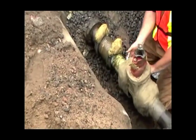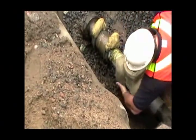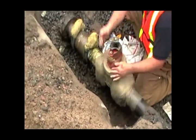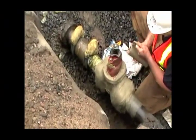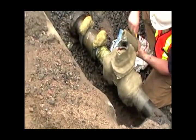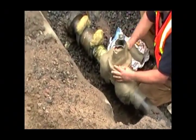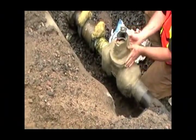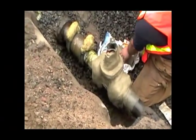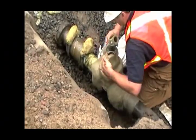Right. Pretty forgiving. Anybody who's ever wrapped a hockey stick, a broom, whatever, you can put this on. I've only done this once or twice myself. Now, if you miss a really small spot, does that make the whole thing useless? Well, that's kind of the reason why you put the paste down first, because it is your corrosion inhibitor. Okay. And for the most part, you'll see any areas. I don't think there's too many areas that I would have missed there, because you're giving yourself at least an inch or two of overlap, you're ensuring that it's sealed to itself and covering that metal surface.